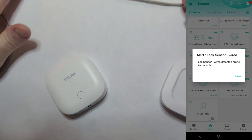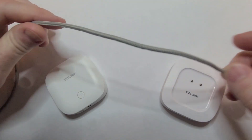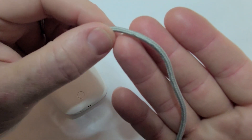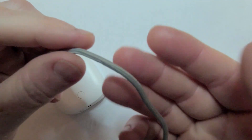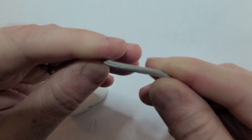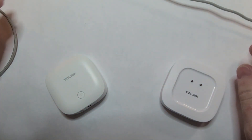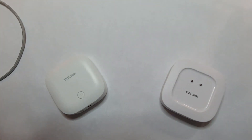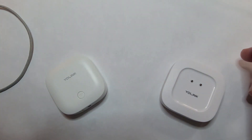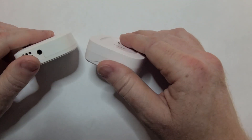I really like this product. They've made the cord so that it lays flat very easily — basically just run that along your baseboards or along the inside of your cabinets, and that way if there's a water leak inside you're going to know about it very quickly. Very well built it appears. That particular sensor runs about $25, and you can actually get a 10-foot extension cable. This one is four feet long and included, then you can buy a 10-foot extension — so 14 feet of sensor, or as long as you want. You can wrap that around pipes, water valves, along the baseboards, around your toilet, around your water heater.